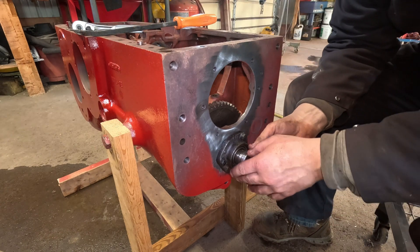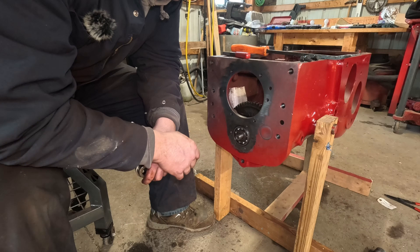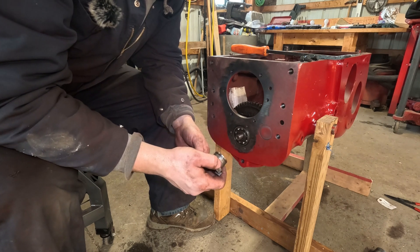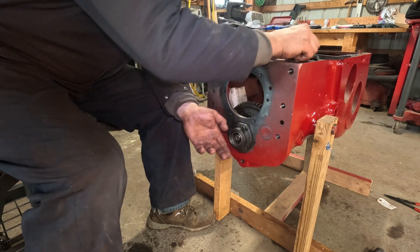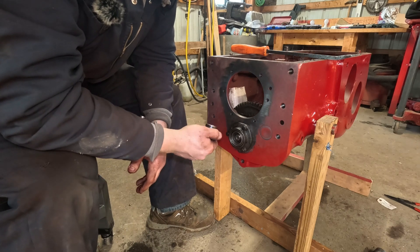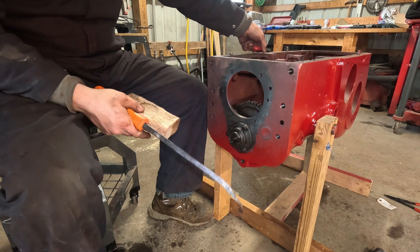Now that those bolts are snugged up, I'm just going to slide this collar in and thread that on a little bit. I forgot — when I took this apart I kind of buggered up the end of the shaft just a little bit, so I had to take the bearing retainer back off and use a thread file to clean up the end of the shaft just a little bit. It wasn't a lot, but I was able to get this coupler to screw all the way on, so now we're good to go. I'm putting these on finger tight for now — I have to take this back off and put the gasket and seal in there.